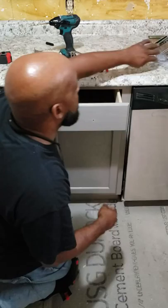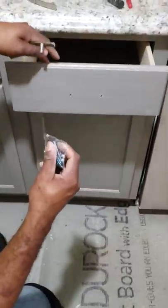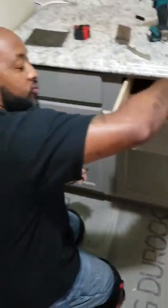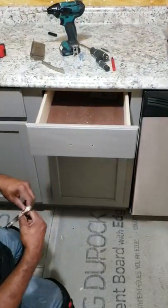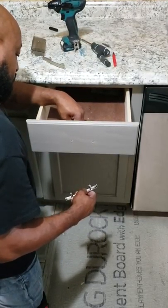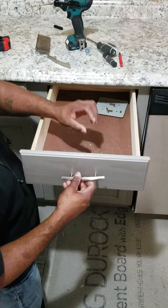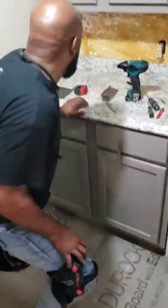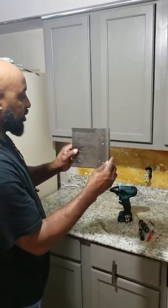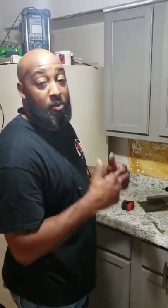You've got those two holes there, and you're going to take the pull. They have a package that has long screws and one with shorter screws. The drawers always have longer screws because there's some extra wood inside the drawer. So you just screw it in from this side — you can use a regular screwdriver or a smaller screwdriver to get your hand in there easier. Just make sure you buy these templates — this is the whole key to doing this yourself at Home Depot, Lowe's, or any hardware store in your town. Hit the like button if you like my video, I've got more to come — thanks for watching.